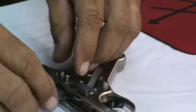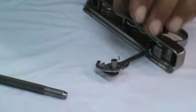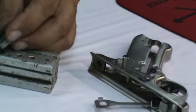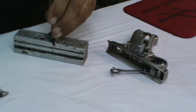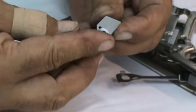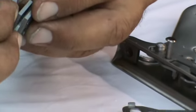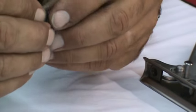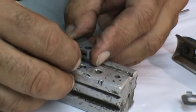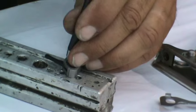I'm going to take out this hammer, pull out the pin enough to release the assembly, and pivot it up. These are the components of your mag disconnector and we're not going to use this hammer - we're going to use the hammer that came in the 3.2 kit. In your 3.2 kit you've got a hammer and a new hammer bushing. The difference is this hammer has no relief cut - the sides are parallel. As we did earlier, we're going to reinstall the strut into the new hammer. The easy way is to come to a bench block, line up the pieces, and tap the hammer down onto the pin, then give it a little dimple to keep it snug.